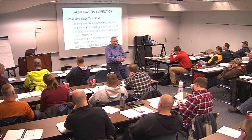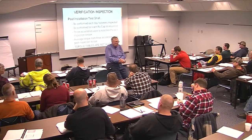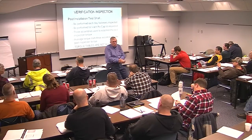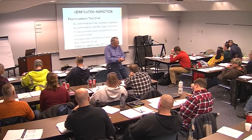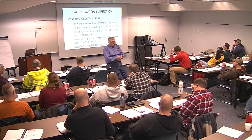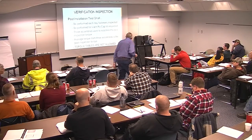So how do you verify it? Go back out there and pull a sample and see how they perform. Pull one out of the connections and see how they perform for you. Do they work? Do they tension the DTIs properly? Are you over tensioning the bolt to the point where you're overstressing the bolt to get those DTIs crushed even? So we need to get out there and do some checking on that. And it's not a good situation to leave the bridge sit there with them bolts just in the snug condition. They need to be tensioned.